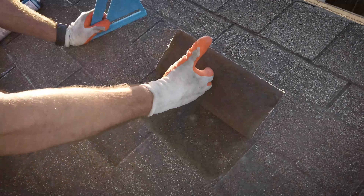Now that we've done the brittle test, we can safely say that this slope is unrepairable. The next step as a homeowner would be to find a roofing contractor you can trust — someone that actually understands how the insurance process works and can meet with your insurance adjuster to go over a brittle test on an older roof to get a replacement instead of a repair. The insurance company's first thought is going to be to just replace the missing shingles, but if your roof is this old and you can show with a brittle test that it's unrepairable, you can get the insurance company to replace the entire slope, which is much better for the longevity of your roof.